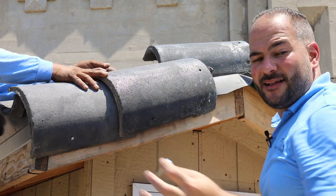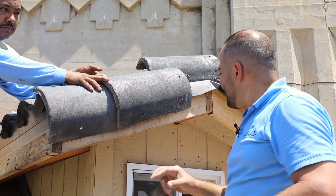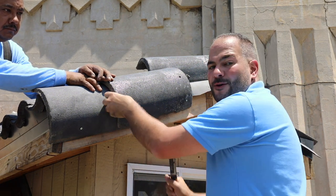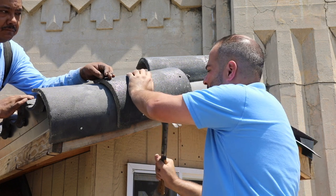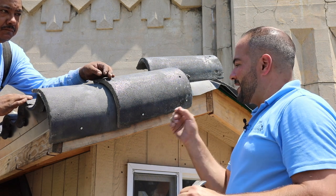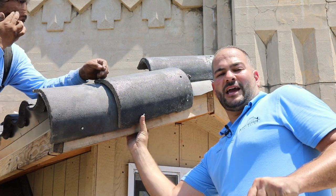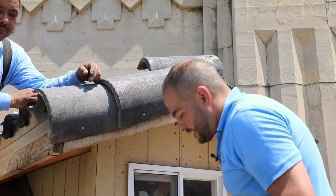As far as your nail length, keep in mind that the nail at the front side might be a different length than the nail at the back because of the fact that it's raised up. So just be very conscious of that. The last thing you want to do is finish installing your rakes and see that you've penetrated through on the other side. For example, that nail was too short — I only got a quarter of an inch of a grab. For this demonstration it's totally fine, but on a real-world application, you would want to change that nail so that you get a good bite to keep your rakes in place.